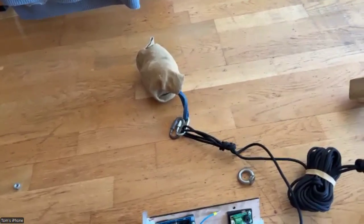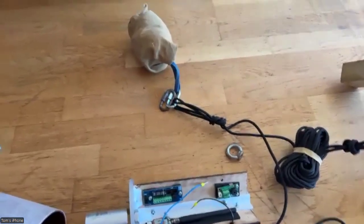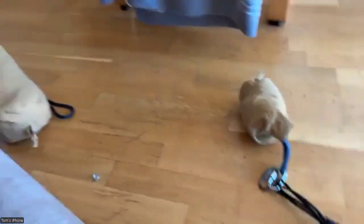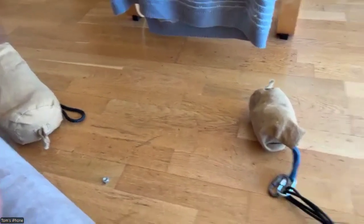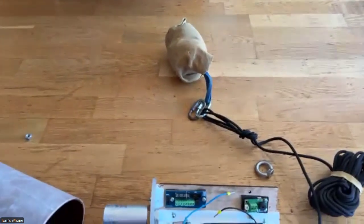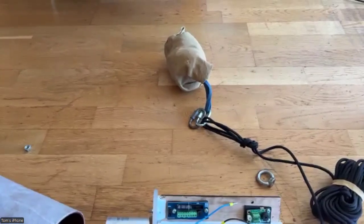That's the other way around. Yeah, the other way around, sorry. Drogue will be 25.1 meters per second, and main will be 6.3 meters per second. We've flown both of these parachutes before on a slightly larger rocket, and the calculations are kind of in line with our previous experimental data as well.